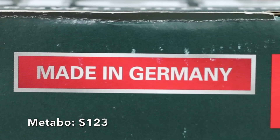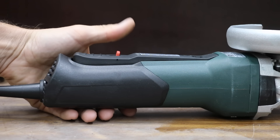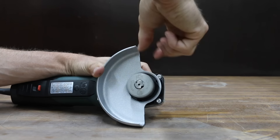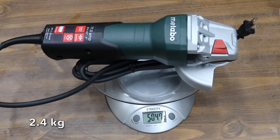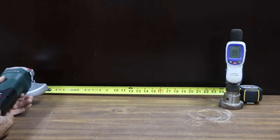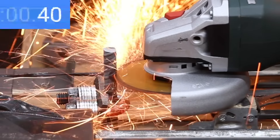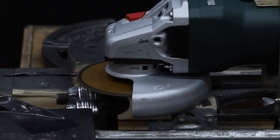At $123 is the Metabo. You can change the blade guard angle without tools. Unlike the other brands, the Metabo uses a paddle switch and includes an automatic mechanical safety clutch capable of 11,000 RPM. It weighs 5 pounds 4.7 ounces. At 99.7 decibels, a no-load speed of 9,740 RPM was measured. The 11-amp motor on the Metabo maintained pretty good blade speed and made the cut in 4.8 seconds — about half a second slower than the DeWalt.